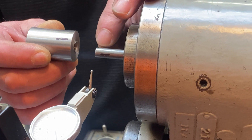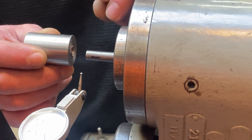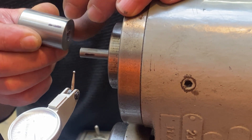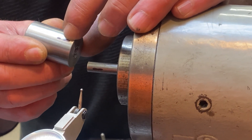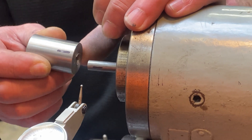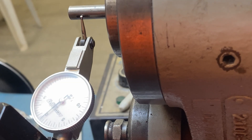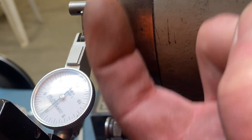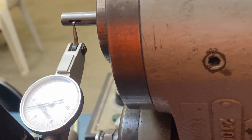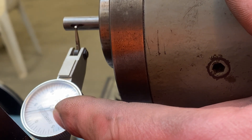When it comes to this cam relief, you only care about what's happening in the first little bit. I'm using this marker line here to represent the cutting edge — the upper side of the marker line would be the cutting edge — and the width of the marker line is all I really care about, because that's where the amount of relief matters. Here I'm at my pretend cutting edge, which is the upper side of this marker line, and as I rotate through to the bottom side, you can see I've got 3 thou of relief registering on my dial indicator.